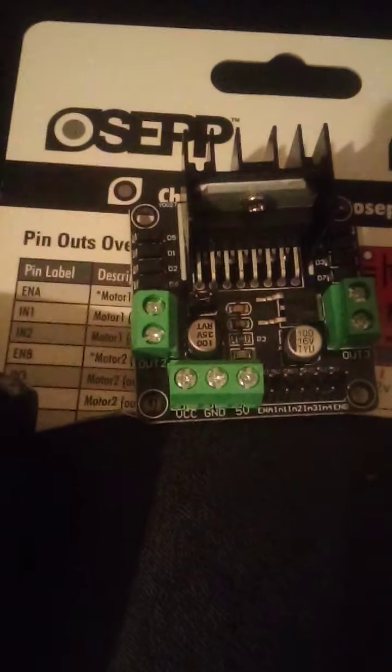If you want to control something like AC, that's 120 volts, like your incandescent lamps and not so much an LED, I would suggest using a relay board. There are plenty of relay boards online that will take the DC input from a Raspberry Pi or Arduino, and with a built-in transformer, it will step it up to control that 120 or 110 volt lamp or whichever you want to use. But definitely an awesome thing to have. These guys work just great.